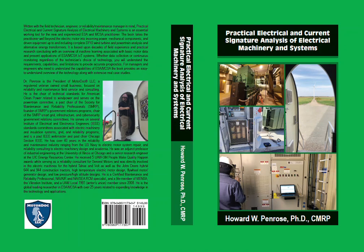In 1996, as I was negotiating my transition to the University of Illinois at Chicago's Mechanical Engineering Department as an Adjunct Professor of Industrial Engineering and Senior Research Engineer within UIC's Energy Resources Center, I became the Vice Chair of the Chicago Section of the Institute of Electrical and Electronics Engineers (IEEE) and the Fox Valley Subsection Vice Chair. One of the other leadership of the Chicago Section was a principal of an engineering firm that oversaw the Chicago pumping stations, which moved fresh water from Lake Michigan through Chicago and the suburbs. He contacted me as they had a problem with a vertical, 900-horsepower pump synchronous motor that had snapped a 24-inch diameter coupling. He brought me several printouts and one of the datasets was MCSA data. I noted a specific pattern around line frequency that looked like pole-pass frequencies, a high one-time running speed sideband, and very high harmonics around line frequency peaks that could also be associated with dynamic eccentricity.